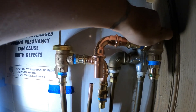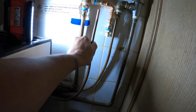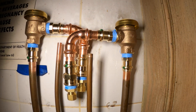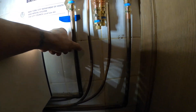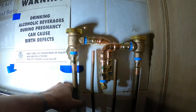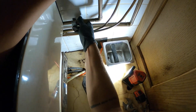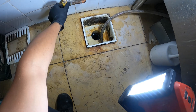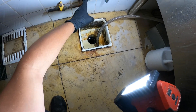So what I got to do is cut this pipe back and shift it over — shift this pipe over a little bit this way. This one I need to move it a few inches. Let's build it out and see what I need. Definitely things crossing up — I could probably make it work but I want to make it look nice. So I can move this pipe, cut it, and move it back. These valves are so bad, it's very difficult to close it. They don't know where the water is, so I'm actually just going to press on new valves right there when we do the sink.